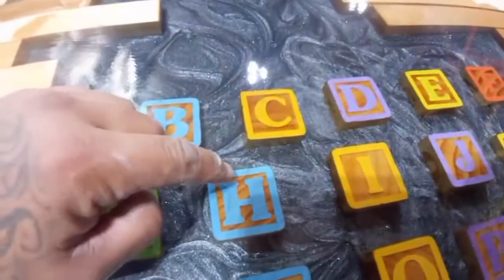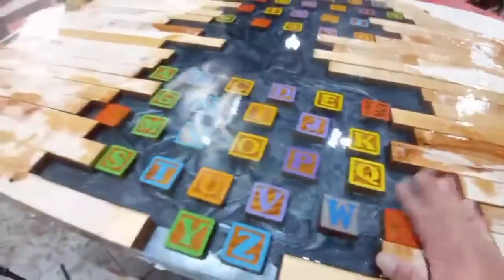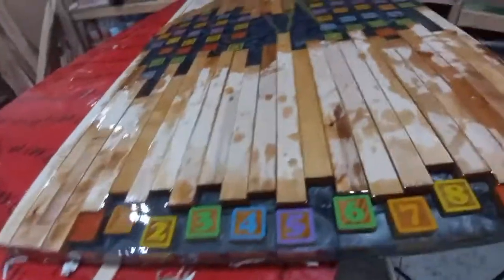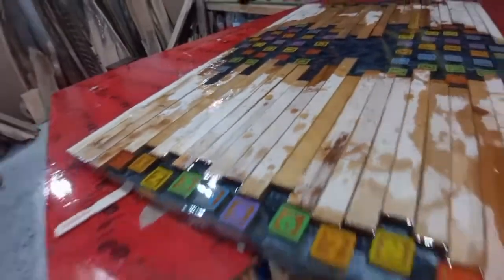So here was one — there were just some bubbles that would not stop. The letters just kept coming and coming. All you do is take your drill and a drill bit, drill down the air hole, then do another layer or fill it with epoxy, and you would never ever know. The only way they'd know is if I said something like I just did — and even then they wouldn't be able to find where it was.